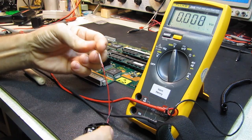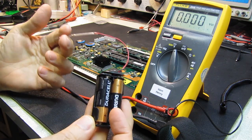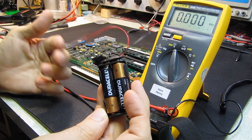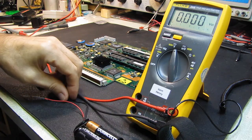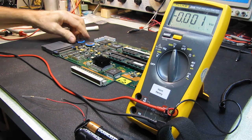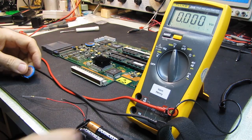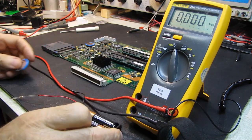I have a 1500 ohm resistor here that limits the current to about two milliamps maximum out of this pack. The reason I do that is there's going to be a voltage difference between the new rechargeable cell and this double-A pack.